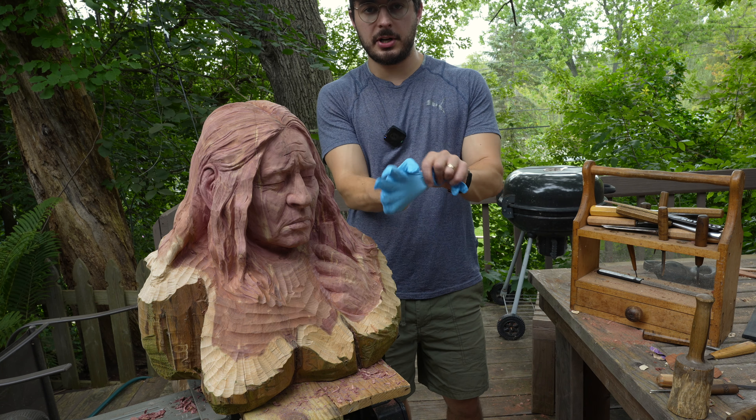I'm going to use a combination of paint thinner and tung oil. The tung oil I'm using is a walrus oil — it's a really good pure tung oil. I'm going to use a couple of china bristle brushes and have some towels nearby. I like to pull out the loose bristles from the brushes. I like to have at least a couple of brushes — one to apply and one to blot off excess oil.